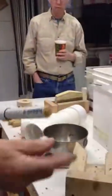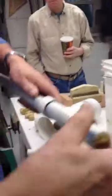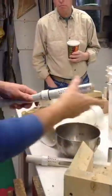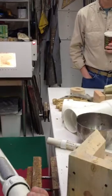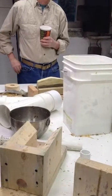You have to start with a plug. When this is empty, you've got to plug it up to get some compression started. I pushed this in there — or you can put your thumb in there, I did that too. You've got to start with compression, and once it gets compressed, it will stay compressed enough. That's how extruder designs work — you must have enough back pressure created by the plug that's in front.